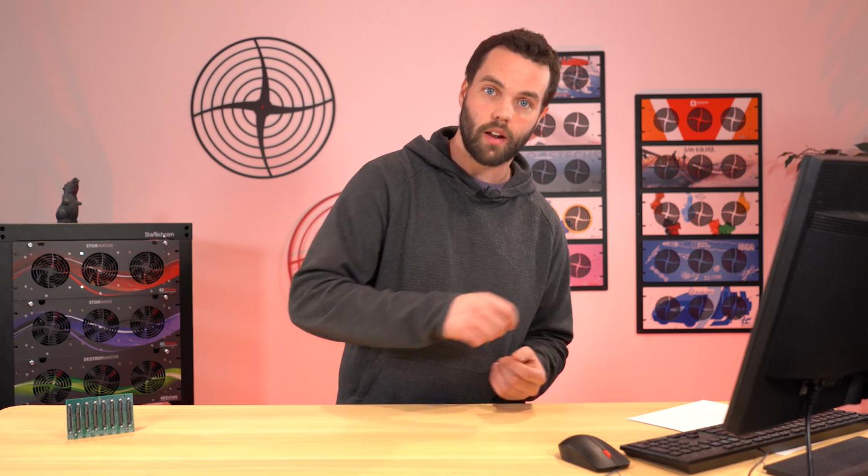All right, let's dive right in. A little bit of history of why UBM, Universal Backplane Management, is even needed or a good idea or is a thing. Storage technologies have evolved very rapidly in the last little bit. You've had SATA and SAS around for a long time. NVMe has caught up and is surpassing everything really quickly. And they're really fundamentally different technologies under the hood of how it all connects. And this diversity in the storage technologies has created, for lack of better words, a wild west of how you connect everything up. And honestly, you wait a few years and now there's a new specification of drive and you need this kind of controller that does it.